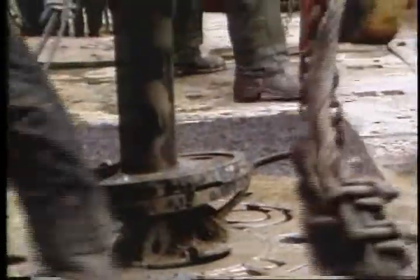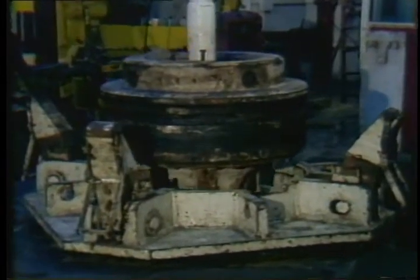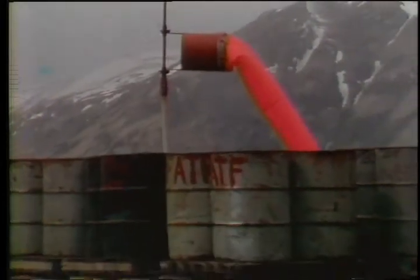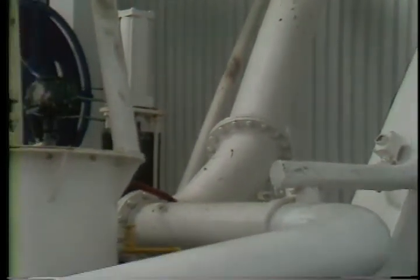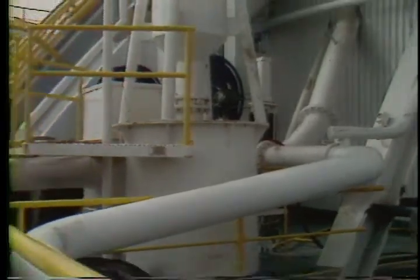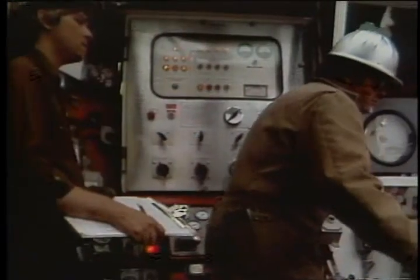As a review, let's look over several of the points we talked about. The diverter is not designed to shut in or halt flow. You should function test the diverter and valves every trip when drilling shallow hole. You should always be aware of wind direction and have the downwind overboard line open. Valves and lines should be periodically checked to be sure they're not plugged with solids. The seals on the diverter and the packer should be kept clean. Everyone should know their duties in case the diverter is used. Be sure you understand and follow the plan your rig has as to when to use the diverter.